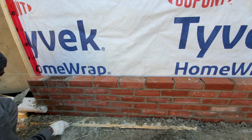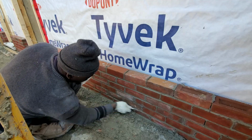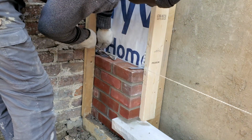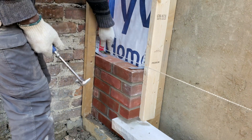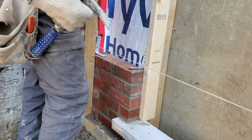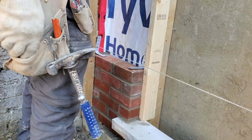We're just doing some joints right now. And remember, you want to leave your weeping holes. I like to leave my weeping holes and clean them out afterwards. Right here I use some concrete nails just to hold that one in place as you go up.